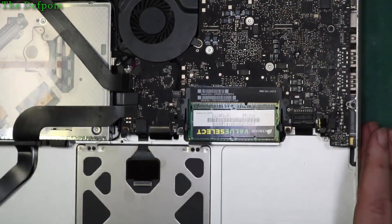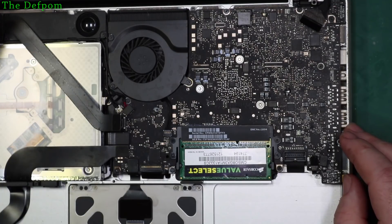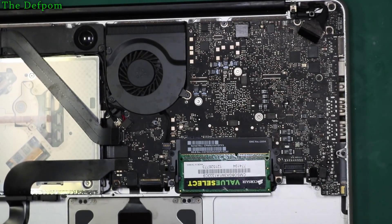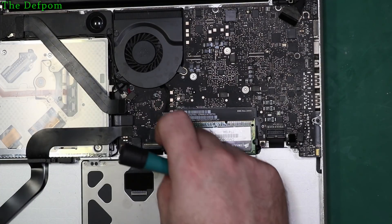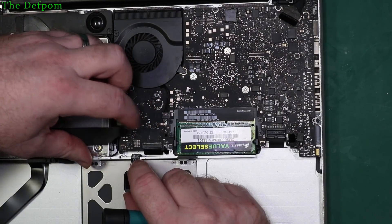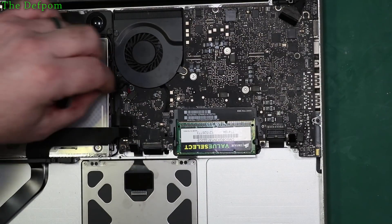I really need to take this board out of the unit, give it a flux, hot air, then just see how we go. If it still plays up I'll check it through ultrasonic as well — it needs to go through ultrasonic anyway. I don't know what the other side of the board is like yet because I haven't pulled it out. There's also corrosion around these connectors, on the cable connector and on this backlight connector. The hard drive connector has a little bit in there too, so we should do a bit of cleaning.